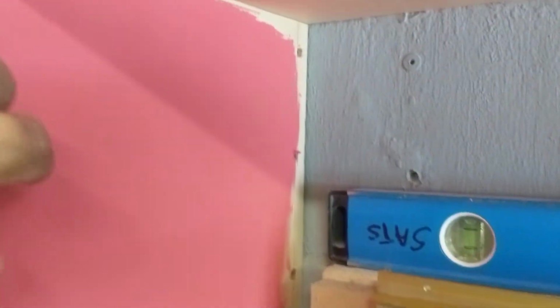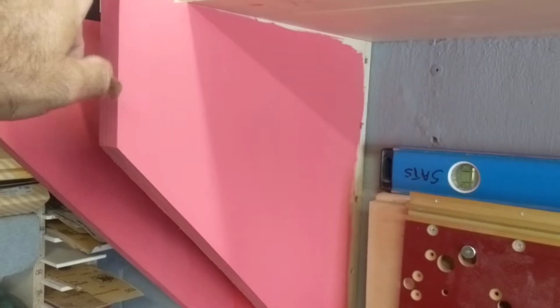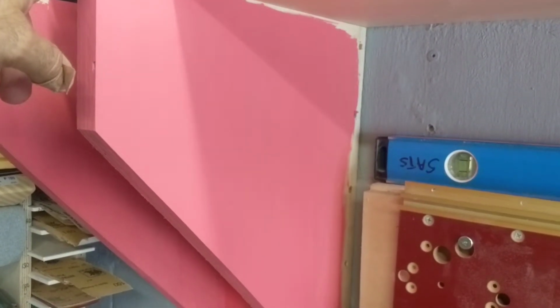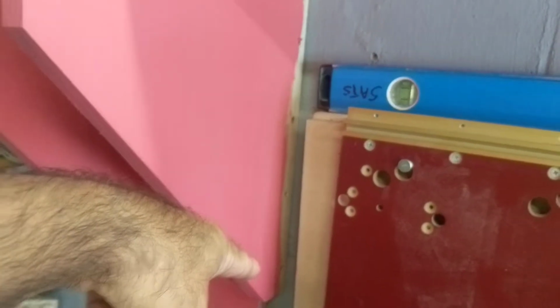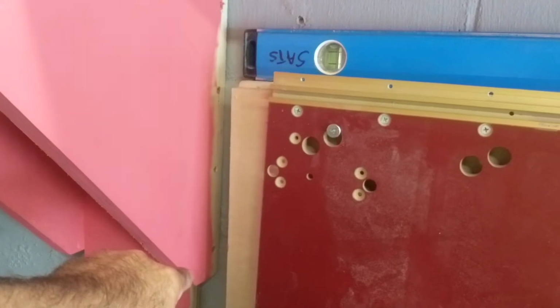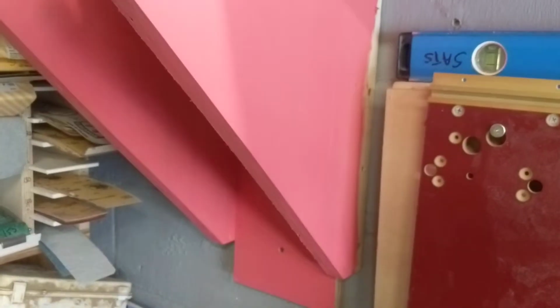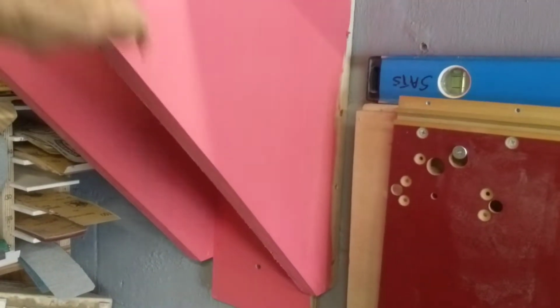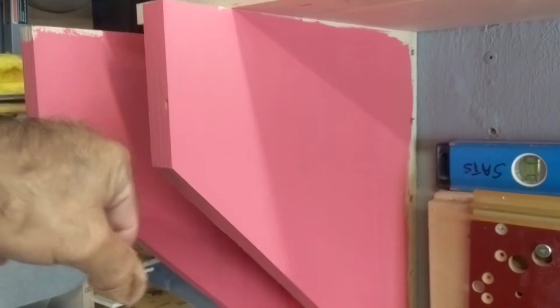And what I just did was I screwed it to the sides. And one of the things when you make this is come down on your wall side long. Don't run your angles short, and that way you have a lot of strength in your leg going back down the wall. Again, this is 16 inches, probably about 18 inches, cut out of a 20 by 20. And then you see I just lobbed off the point that would be here.